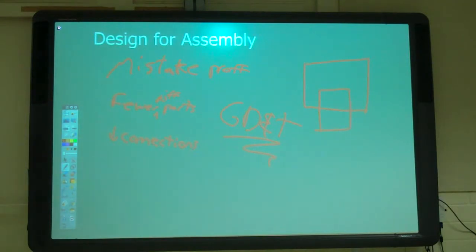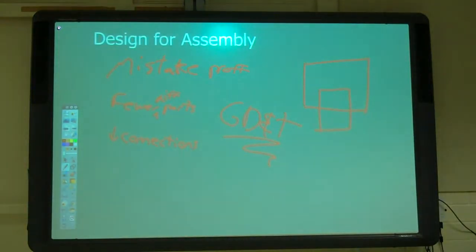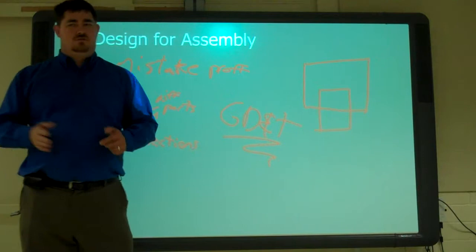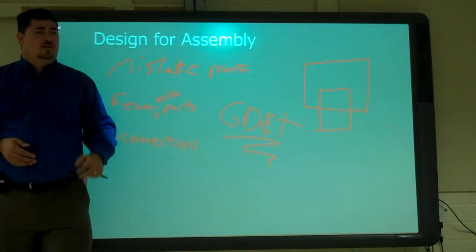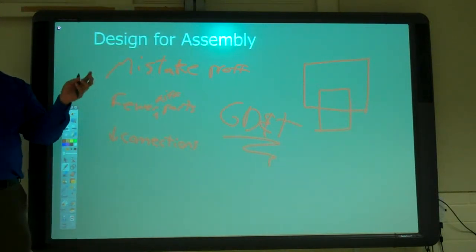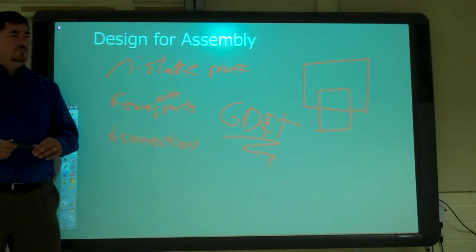So if you make sub-assemblies, maybe you make two different things. If we were doing desks, we could make this desk and make a bigger desk also, right? What would we have to change? Yeah, we'd have to change this part, that part, the back sub-assembly, and these two cross members. But the legs are the same exact thing. So those legs could be used on both products without any changes. The manufacturer could make a ton of those legs at one time, half of them for this product, half of them for the bigger one, and then just cut to the size they need. So you're reusing a part from another existing product, not trying to stock something new, something different. Okay? Any other things?